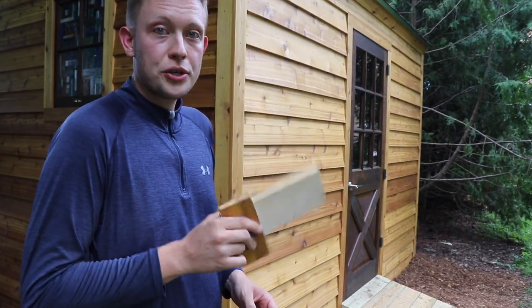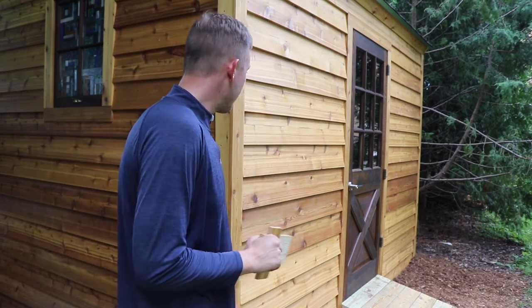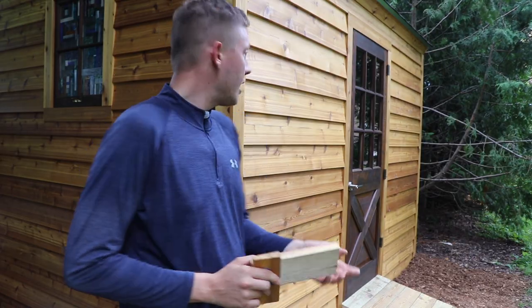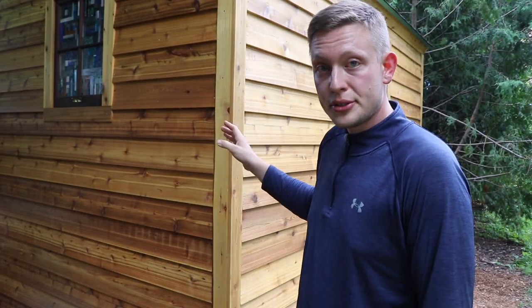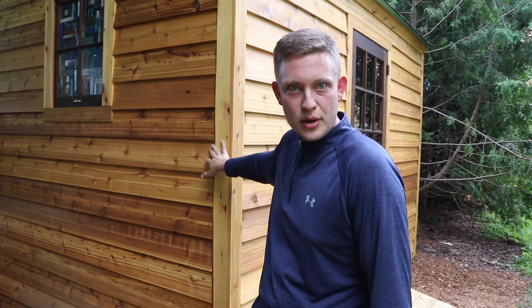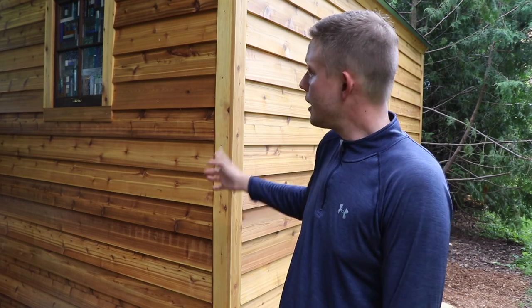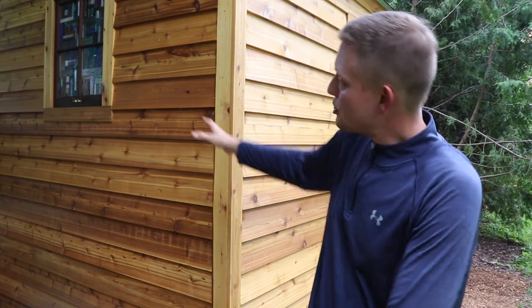Two important things: first, make sure you're nailing into your studs. If you're only nailing into the sheathing, you won't have the rigid support you need for a long-lasting product. Second, use the right kind of fastener. I went with stainless steel, which is stupidly expensive — copper would have been even more so — but I know it's not going to rust. If you use the wrong fastener that corrodes with rain, you'll get orange streaks sliding down your wall. You just spent all this money on cedar and all this time making individual cuts, so don't skimp on your fasteners. Stainless steel also looks beautiful and when you're looking at the whole picture you really don't even see the nails.